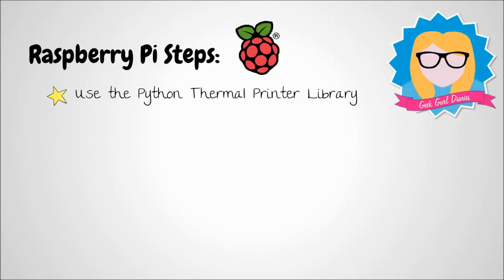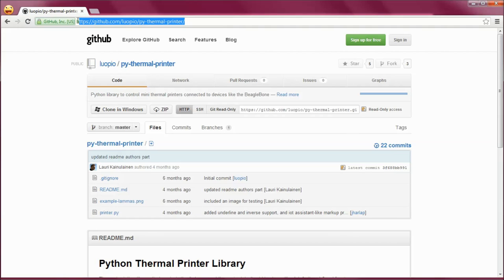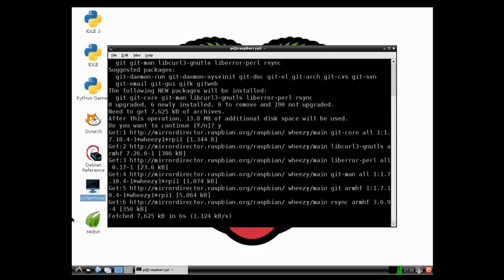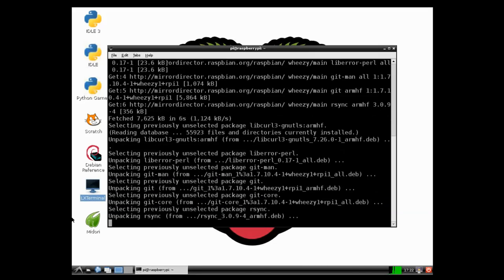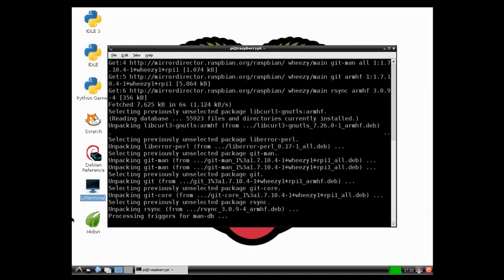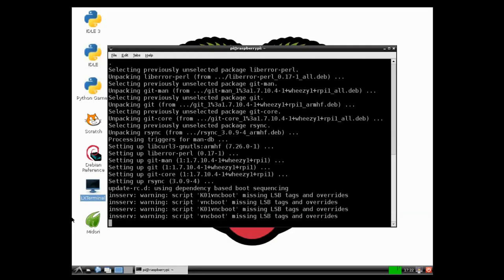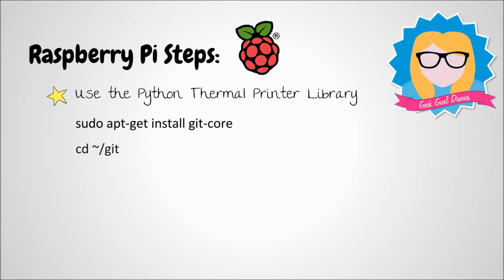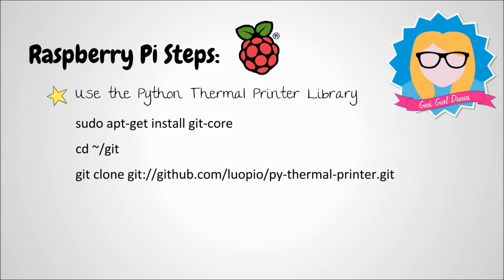So we've set up the serial port on our Raspberry Pi. Now what we want to do is get our printer actually printing. We're going to use the Python thermal printer library that already exists. To do this we're going to go onto the internet and look at GitHub — there is already some code on GitHub and we can download it straight to our Pi. First of all we need to apt-get install git-core so that we are able to pull directly from GitHub onto our Raspberry Pi. We are going to use a repository on GitHub that someone else has already created — you should be able to search for this, or I will put some links in the description below this video. On your Raspberry Pi it's a good idea to create a directory to put all of your downloaded git files into, and then we can download the Python files that we need.